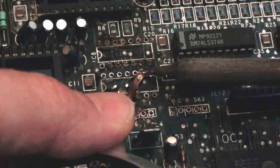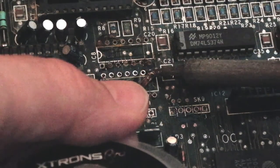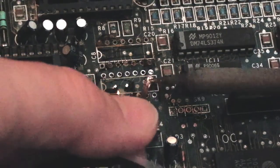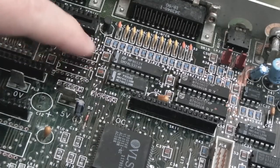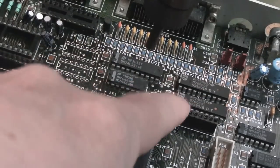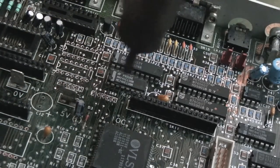When I remove the two chips to the right, I'll show you that in a minute. We'll remove it with hot air and I'll show you some of the cleanup work there if I can. Again, you might not be able to see very well because of the light. So you can just about see from there, cleaned up around there quite a bit. I'm going to remove these two next. This connector is going to be replaced, so I'm not worried about using Kapton tape, and the other sockets and things to the left there are all going to come off as well.